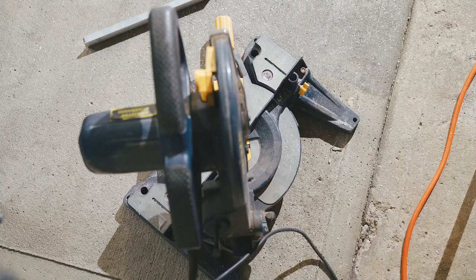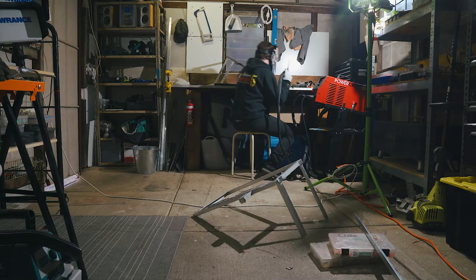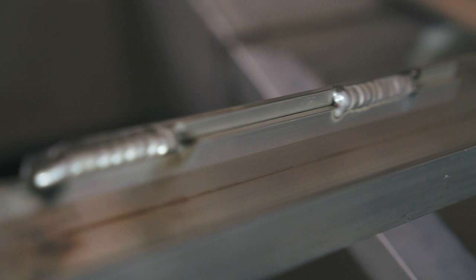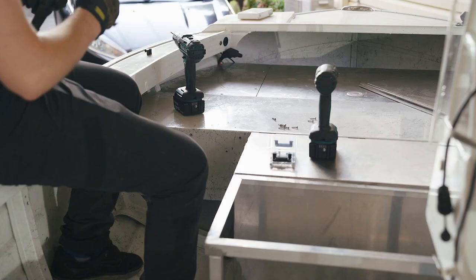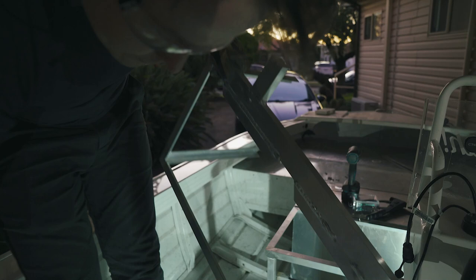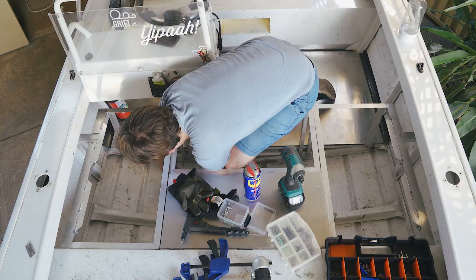With the same logic in mind, I decided to add additional welded platforms to the side frames, with small gaps in between to provide a mounting surface for the stainless steel hinges. Being able to remove these modules from the boat and work on them on the bench makes life so much easier — being in a good position to weld is so important for decent results. With the side module mostly complete, I could begin setting rivnuts in place to secure the frame. I've been mostly leaning towards using the countersunk aluminium rivnuts, because they ensure the frame can seat flush against the surfaces without any unsightly gaps, as well as less likelihood of flexing and bowing.